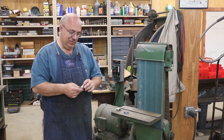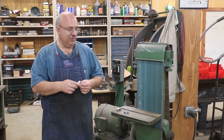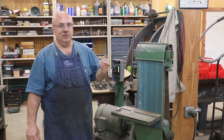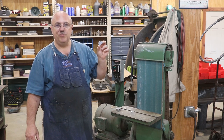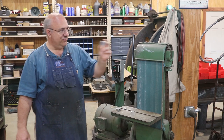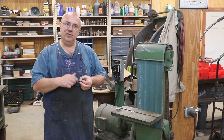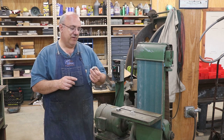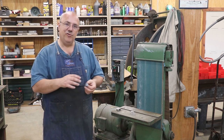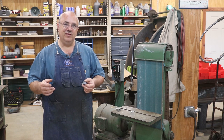What I did was I took the originals off and I sent them to my friend Charles Marlin, who is really good at drawing things up in CAD. He actually 3D modeled them. We took his 3D models and 3D printed the actual model just like it. I checked everything to make sure it was a fit over on the lathe. From that, he took it and scaled it up for shrinkage, added a little bit of material on there to be machined off. We took the holes out and actually created a set of patterns, put some draft in it where they could be withdrawn from the sand.